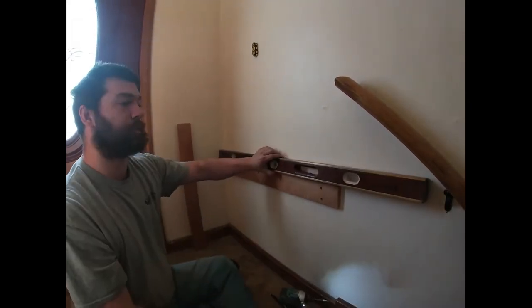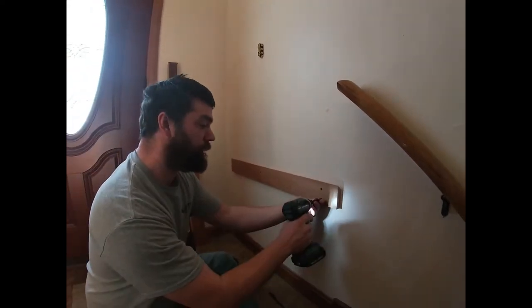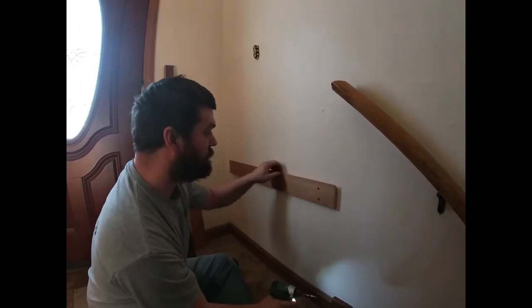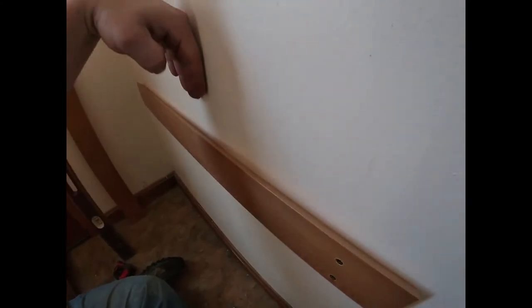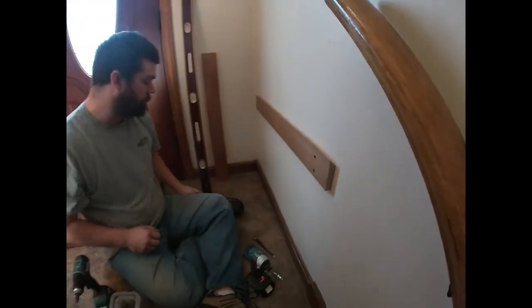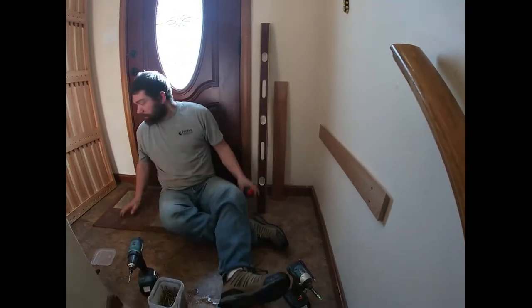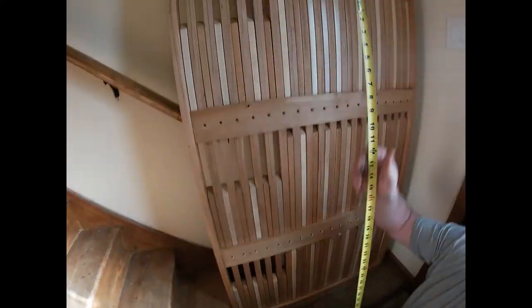Key thing about a French cleat is don't accidentally put it on backwards. You can always change it, but sometimes it catches you. The board on the rack is meant to grab like this, so it won't pull out. You can accidentally put those on upside down sometimes if you're not paying attention. But over here, now, the next French cleat is up